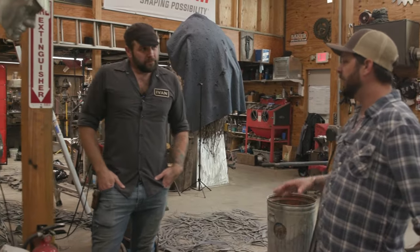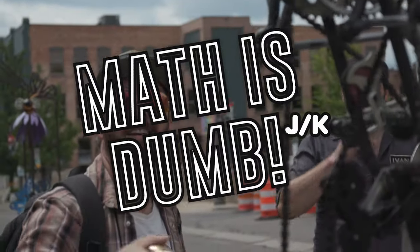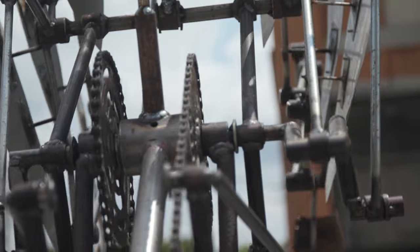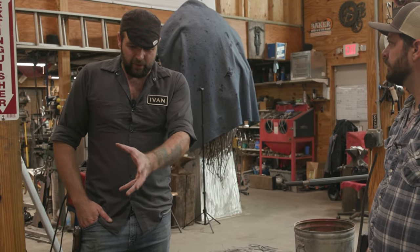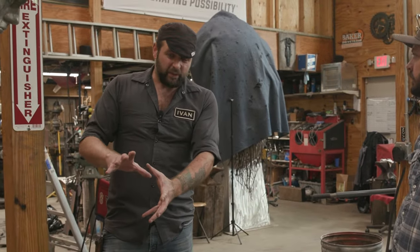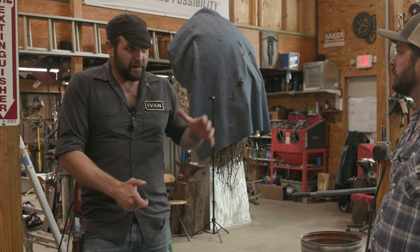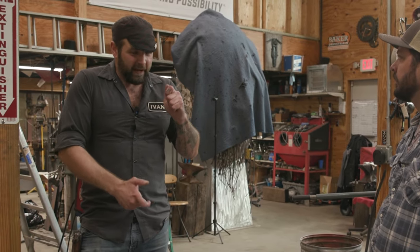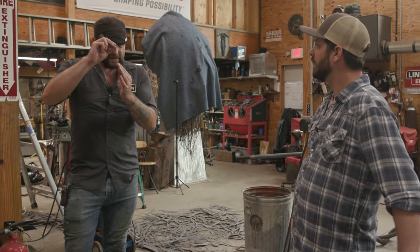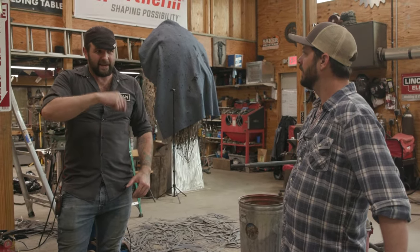How do you get the timing down? What kind of math or measuring do you use? No math. No math or measuring. I'll build the followers, connect the cables to the followers, and then I'll move the cams — turn the motor on, let it move to a certain position, here's my starting point, just mark it with a Sharpie. Now when I'm in this position, I want him to be here, so this cable has to be here, this mechanical component has to be in this position. I'll move that follower alongside the cam until it's in that position, make a mark, do that all the way around, and then connect the dots.